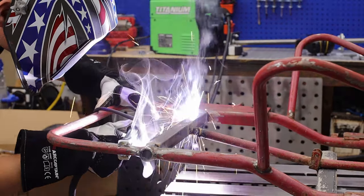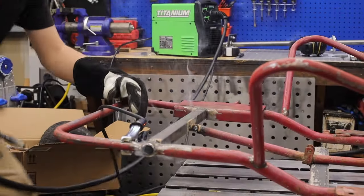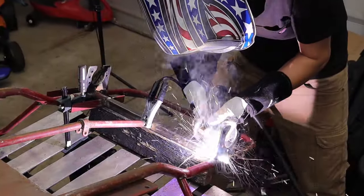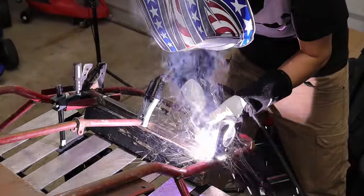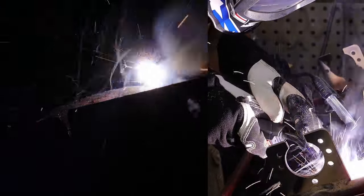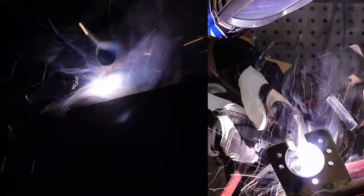If you're like me, you never find the exact shape you need. For example, I had one-inch square tubing that needed to go to one-inch round tubing — you can make it work, you're just going to be practicing filling some gaps. Another example: a 3/16ths-inch bearing plate down to a round tube frame — no issues, turned out great. Settings I used were about E and 6.